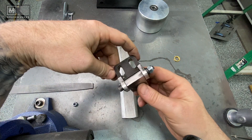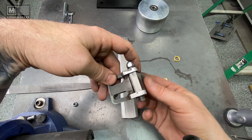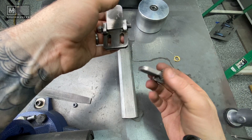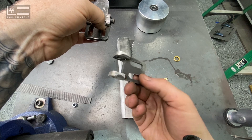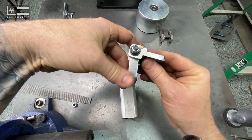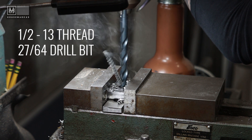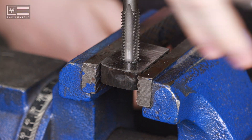With the technology I have access to — the Langmuir Systems Crossfire Pro — I can dream something up in a day, draw it in Fusion 360, and rapid prototype it within a couple of hours. My first prototype is ultimately a failure — just a little too thin, I need another quarter inch on it. Working in CAD is great, but holding the piece in your hand there's just no substitute. Next I'll drill a hole and tap it — it's a half-inch 13 hole, so a 27/64 bit — then we'll be able to thread this bolt in and use it for tracking.